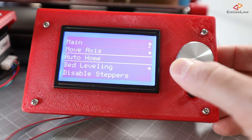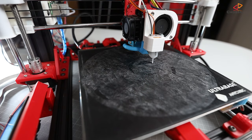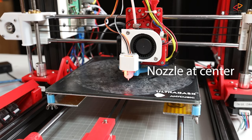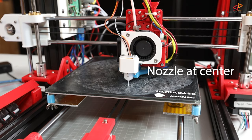The new firmware is installed on the printer. Let's start by doing an auto-home to see what's going to happen with the BLtouch installed. The new thing you notice is that the printer does the Z-homing with the probe in the middle of the bed. If you see that the homing is done with the nozzle in the middle of the bed, you probably have not set your nozzle-to-probe offset correctly. If you fix that and recompile, you might also need to initialize the EEPROM again to make these settings take effect.